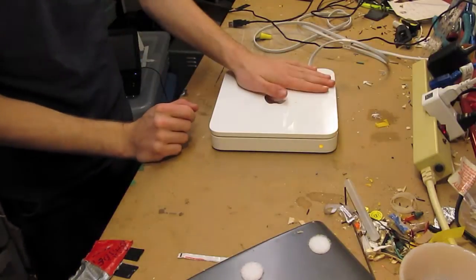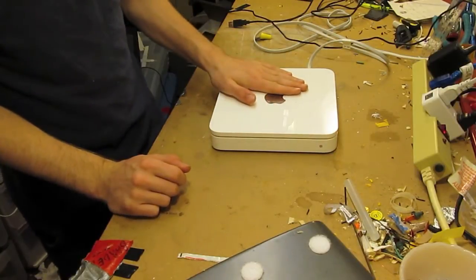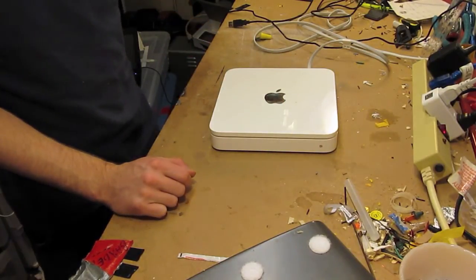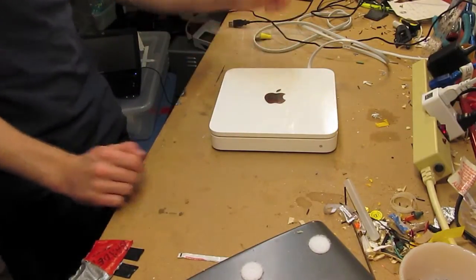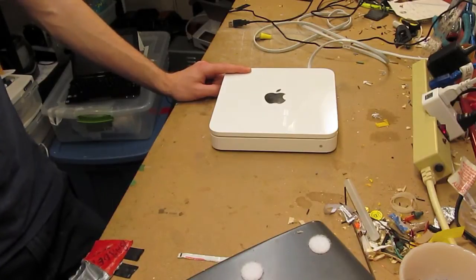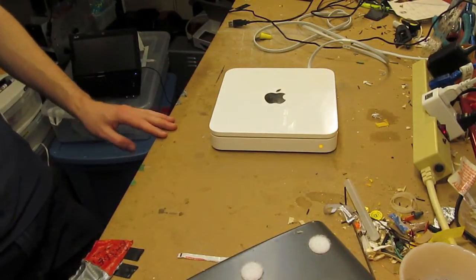We're back. This thing has been running for about two and a half hours. It is quite warm to the touch, maybe 40 Celsius or so, probably a bit more. The case is a bit small for the 13.2 watts I measured it drawing from the mains. However, it has not shut down yet, which probably means the owner was seeing intermittent failure, but not a consistent rapid failure.